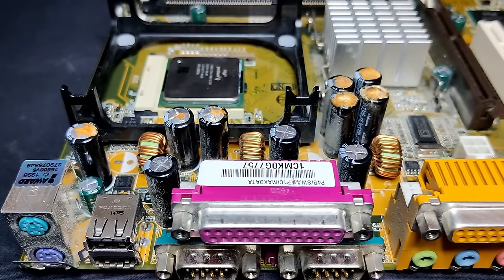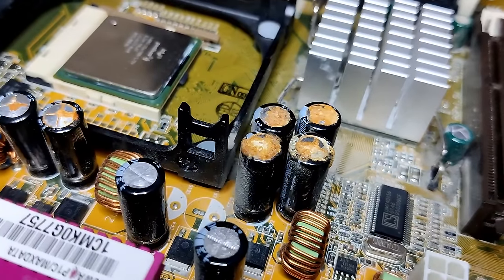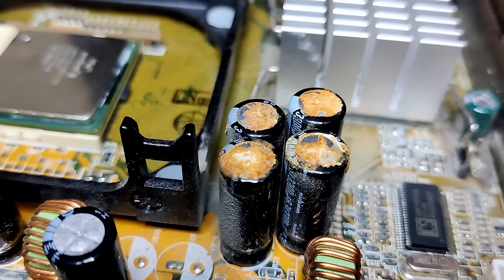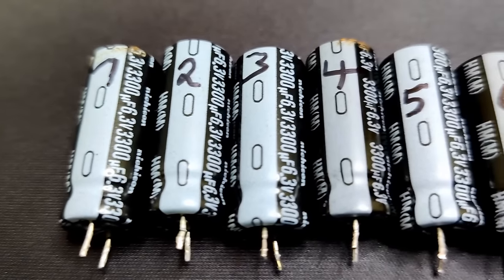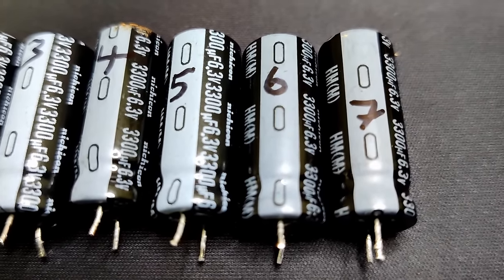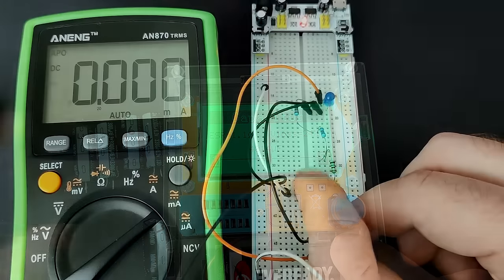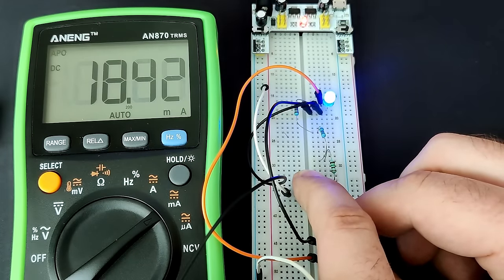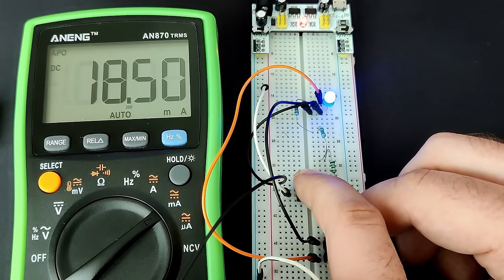Of course, there are cases where a recap is indeed necessary. Take for instance this ASUS P4B released during the capacitor plague, which was in full swing from 1999 to 2007. Boards released during this time should be checked thoroughly, and preventive recapping may not be such a bad idea, even though there is no visible damage around the capacitors. Electrolytic capacitors can degrade internally, leading to increased internal resistance or high leakage current, hindering their intended functionality. So, I wondered whether we could detect a variance in power consumption or observe a decline in temperature of the voltage regulators after a recap.